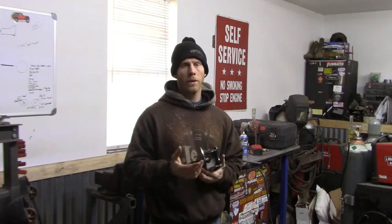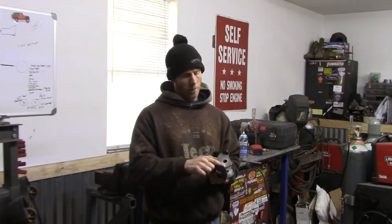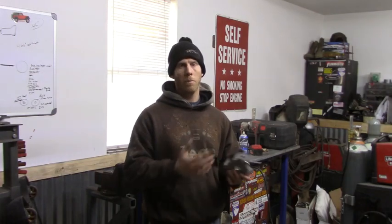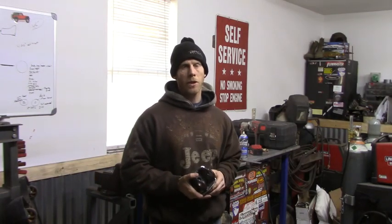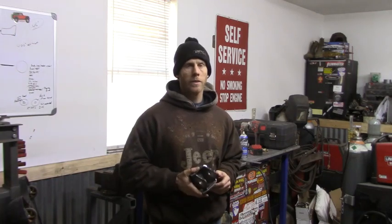And when you're fully welding this up, if you're worried about any metal moving, just move your heat around. Maybe do a bead here, then go move on the other bracket, do a bead on that one, and then do another bead on this one. Just keep going back and forth. And that'll kind of keep your heat down in one area, kind of move it around. So let's go and weld these up, and then we'll tack them up underneath the Jeep.